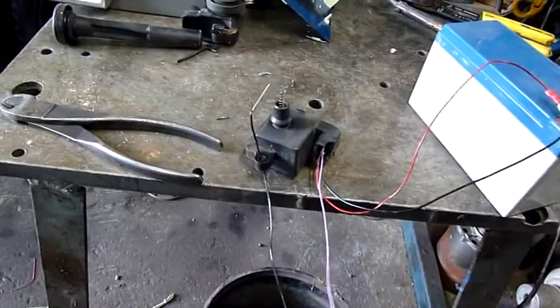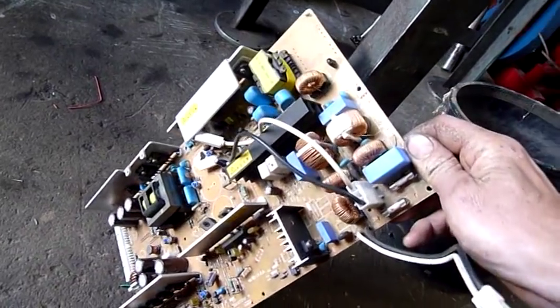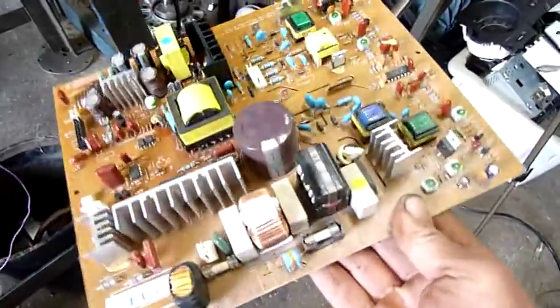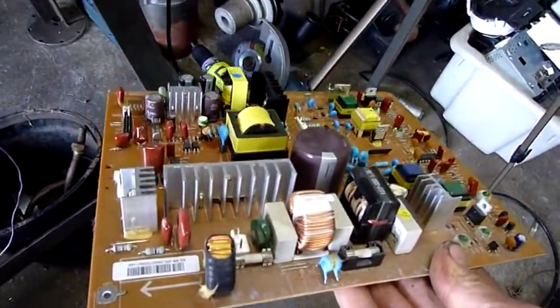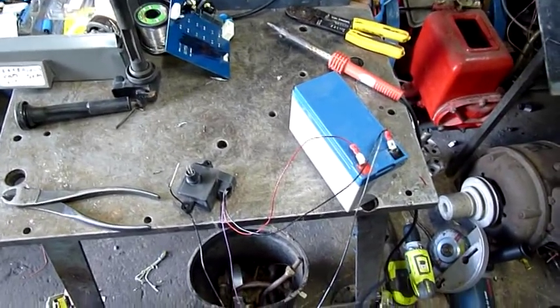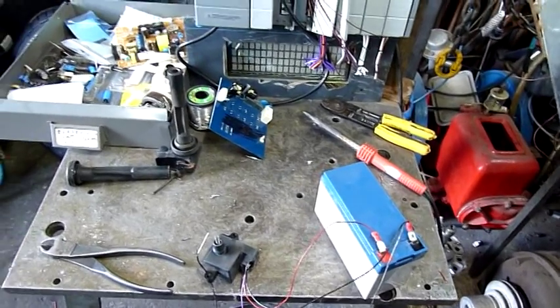Logic says we have to cycle that pulse so many times per second to get a better spark, and that's where the little oscillating relay comes into it. I'll harvest that relay off the board and give it a try. There might also be some bigger relays around here — that's out of a digital photocopier. No relays by the looks of it, just caps. That's out of a Samsung multi-function copier — again, caps but no cube relays. I think the faster it cycles, the better the pulse might be. I had to detune the one at work — I can't remember if I put a bigger or smaller relay on it, but either way we'll find out.